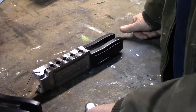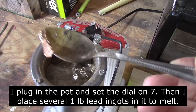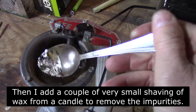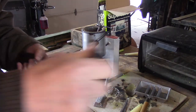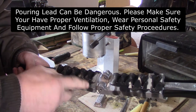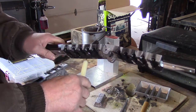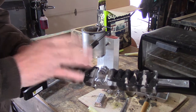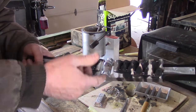The very first thing you need to do with a mold is clean it. It has a little bit of oil on it, so I take a Q-tip and some isopropyl alcohol and clean out all the cavities. Then I take a candle, light it, and hold it up so the soot comes off, and I soot up all the cavities and hook slots in the mold. What that does is allow the lead to release really easily. You don't have to do this every time — maybe once every 50 pours or so, or whenever it becomes more difficult to release.